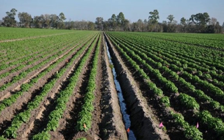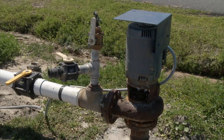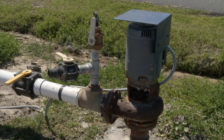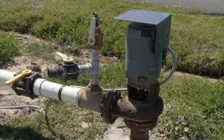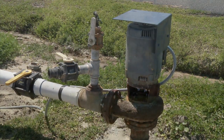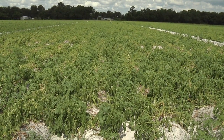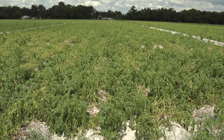Centrifugal pumps have been used traditionally in seepage systems where you turn the water on and let it run until the water table builds up. We don't typically turn centrifugal pumps off and on throughout the day or throughout the irrigation period — you turn them on and let them run. They're only going to be suitable for use on wells where the static water table is 18 feet or less, and even then you might have to pull a vacuum on the well casing to get the water table to rise so that the pump can prime itself.